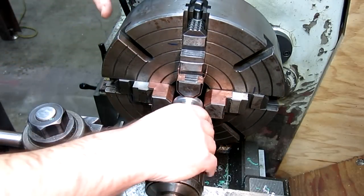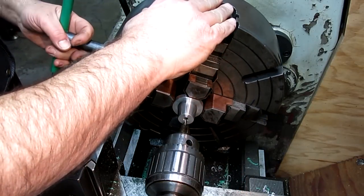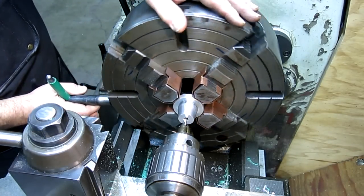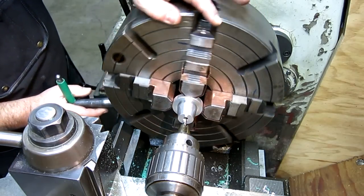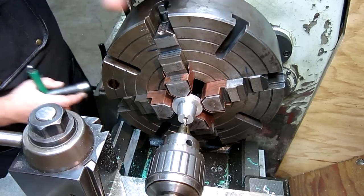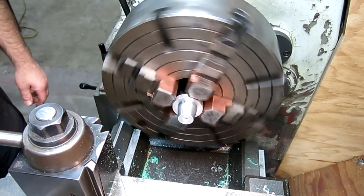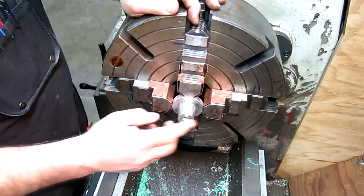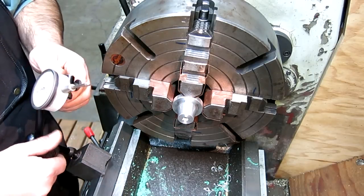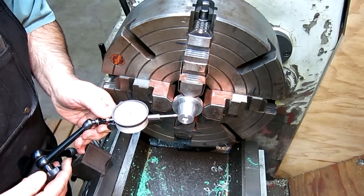Okay. Push it in a little more. Okay. And then we'll just, that's the hard part. I don't want to push it off axis too much. Okay, these are firming up. And it looks like I'm actually pretty close. All right, see if we can pull that out without. Yeah, that works. Okay. And it's out a little bit, so we might bop that around a little to get it straight with the world. Let's indicate that a little bit. So I'm normal to that surface.